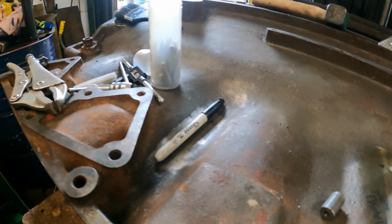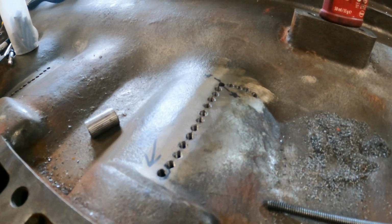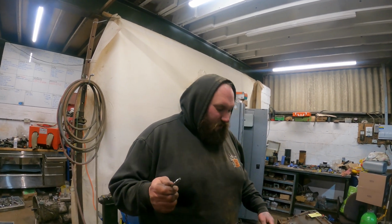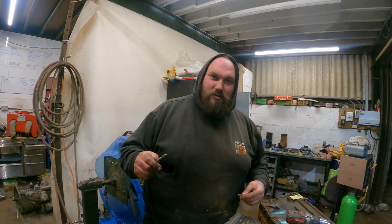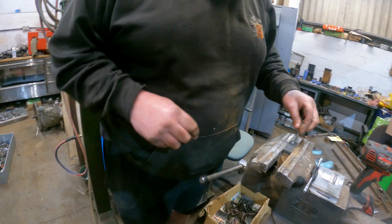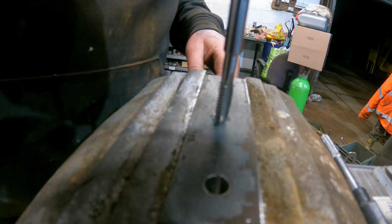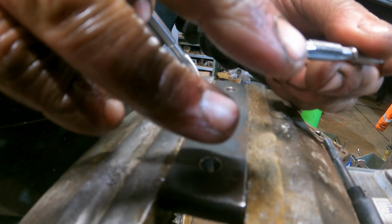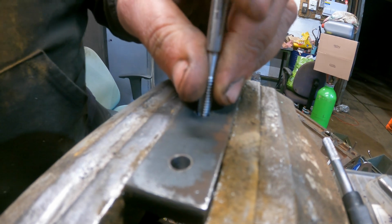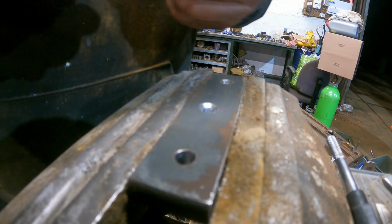We've been back through them with a plug tap. So we've been first, then we've been through with a plug tap and threaded them all the way down. Right, so you hear us talk a couple of different times about a plug tap, second tap, and first tap. Why have I named them backwards, I don't know. It's quite tapered. So you can see that goes in the hole here. That goes in a fair way and then helps you get started straight. Whereas a plug tap is very flat bottomed and doesn't go in at all. So it's quite easy to get this started crooked, and that'll just bind up and you end up snapping a tap.